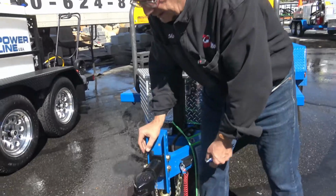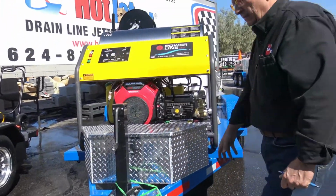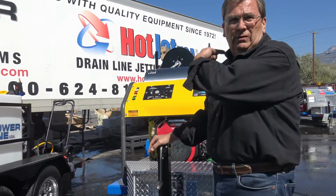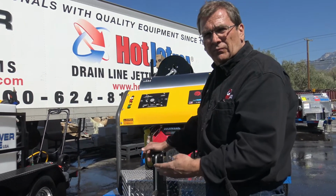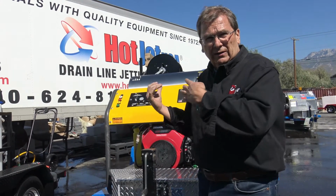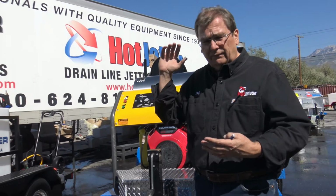Check your bolts and nuts before you head out. Safety chains, make sure your jack's up. Make sure your lights work. Plug your lights in, make sure your indicators are working. So that's basic. Check your tire pressure. That's all on our safety checklist. Check the lug nuts on a regular basis. You don't want tires and wheels flying off on the freeway, right?